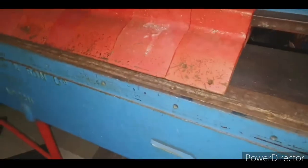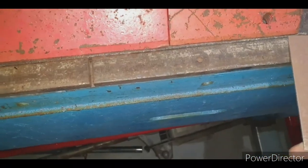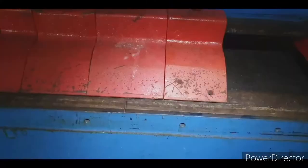This is what I was talking about a few clips ago with the run out on the bender, because these dies just go on and you tighten them down, is you want to align the lip. I didn't have them aligned, that's why the last patch ran out. So you see they got gaps there, but here they line up, so you want to check that.